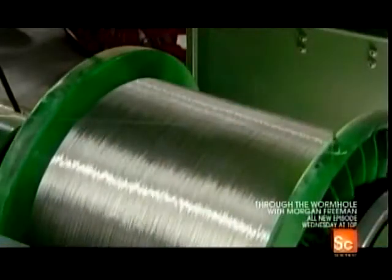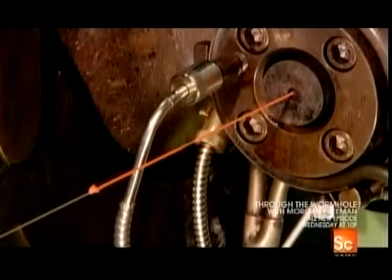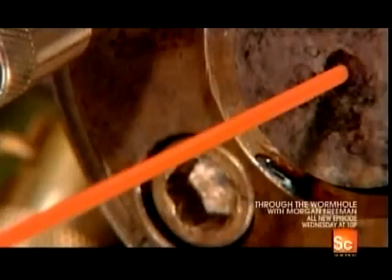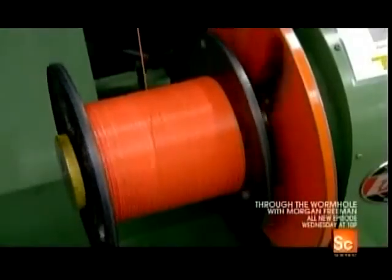Tin-plated copper wire feeds into that extruder, and the colored molten plastic coats the wire to provide an insulating wrap. As it exits the extruder, the plastic casing is still warm and soft, but cool water solidifies it. A spool then takes up the insulated wiring.